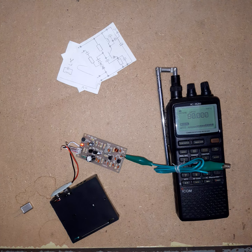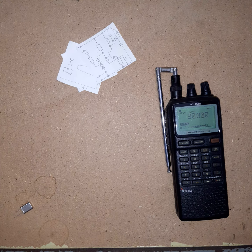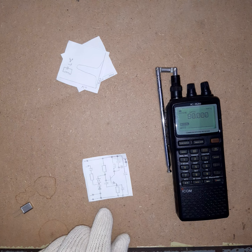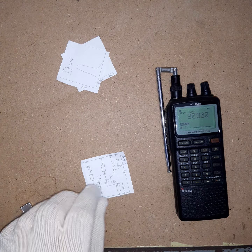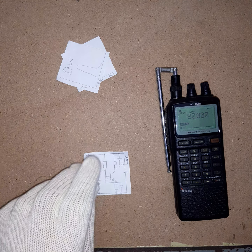I didn't build it, rather it was sent to me. But this is not your solution. Aside from some RF aspects of this thing, there are other aspects too. Other aspects are the frequency deviation, or simply the volume. You can change the frequency of a crystal, and there is another effect that's in place here, the so-called frequency multiplying. You change the frequency 2 kilohertz on 20 megahertz, then on 40 megahertz it would be 4 kilohertz. On 60 megahertz it would be 6 kilohertz, and so on.